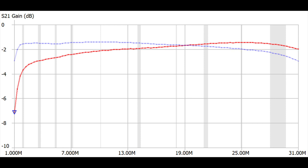And I know lately people are claiming that, oh no, I did 4 turns, 28 turns in this super special wiring where it overlaps back over itself and it's super efficient and you don't even need a capacitor. And there is no way that 4 turns on the primary is going to be efficient. It's going to totally favor the bottom end, period.